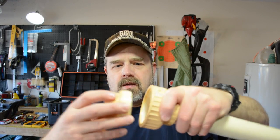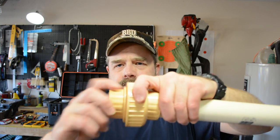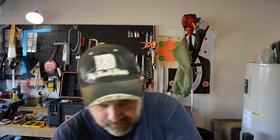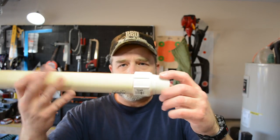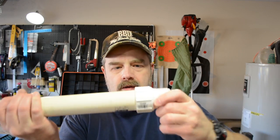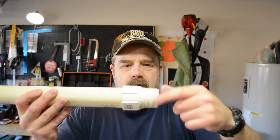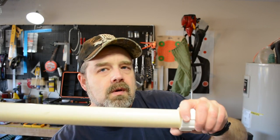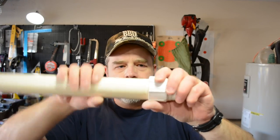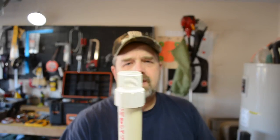just like that, see, you just put it there so you can just slide them together and then tighten it back up. Okay, that's all it takes. So what I did was I took that apart, and then this is connected on this end, and it's just threaded in to the connections coming down from the barrel. And basically, this just wasn't tight enough. I already had plumber's tape, Teflon tape on it. And it just wasn't in strong enough. So all I really had to do was take this loose, stick a wrench on it, turn it in there, and then tighten that back up, just like that. Simple and easy.